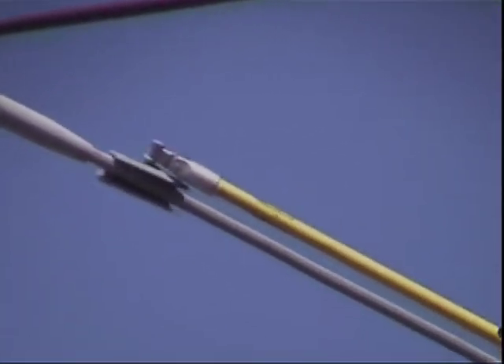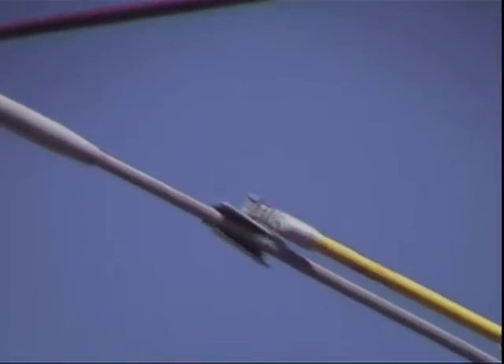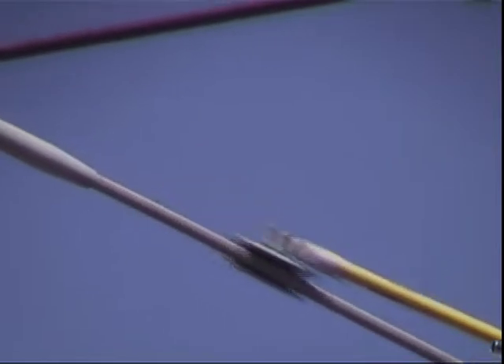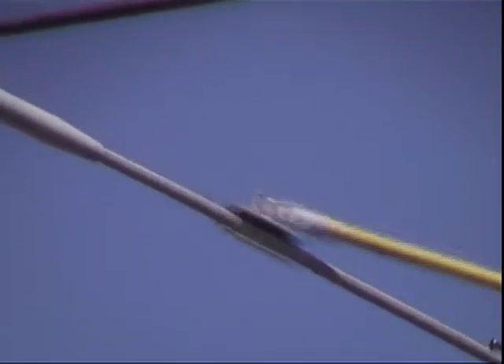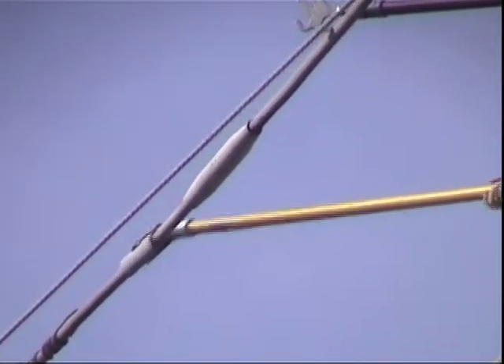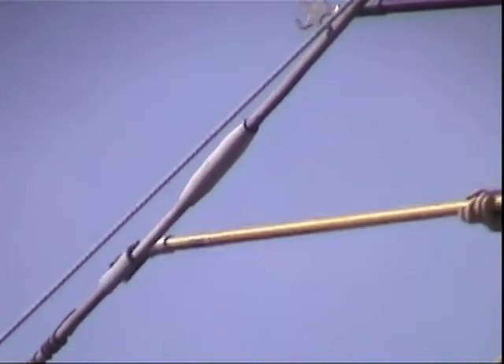It may be easier to mount the brush on a 90 degree angle to allow easier access to the top side of the conductor, the most important surface. While the contact surface of the ClampStar is provided with specially designed teeth to bite through surface contaminants and oxides, proper conductor preparation is always the practice of professional linemen.